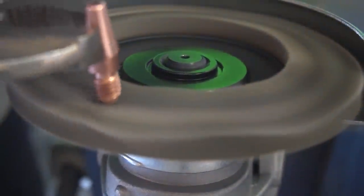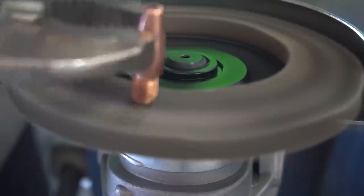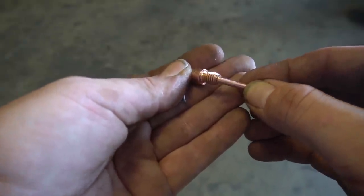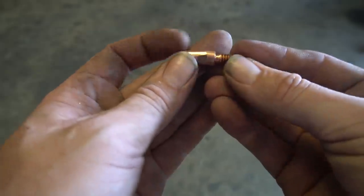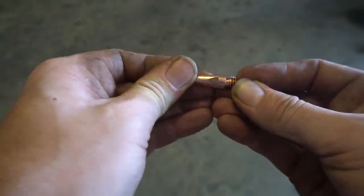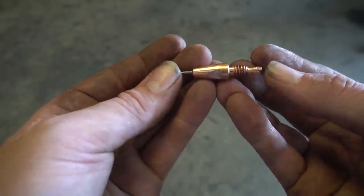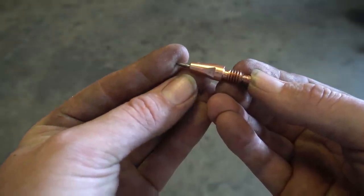To give myself a little bit more compression on that collet when it goes in there so I can squeeze down on the tungsten, I'm going to take just a little bit off the top there. For the final assembly, you should have a MIG tip that serves now as your collet body. You can slide the collet inside of it, and on the opposite end you should be able to slide your tungsten right into the new collet tip body and the collet itself, so that when you install it into the MIG gun, it should compress the tungsten slightly and hold it in place so it doesn't just fall right out.